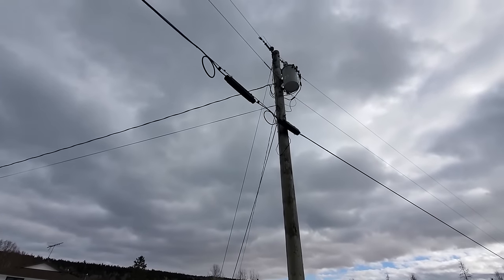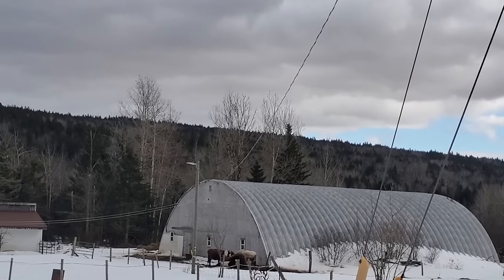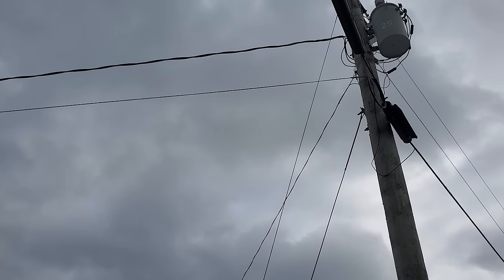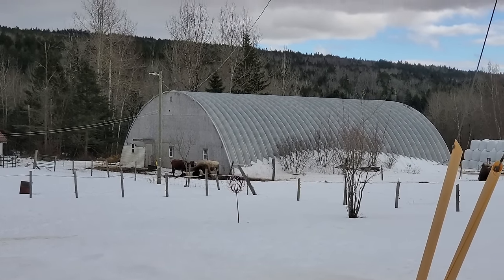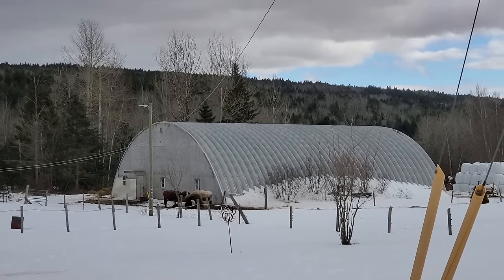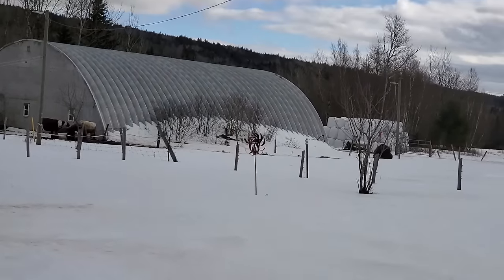Starting here at this location, we'll be able to eliminate a couple of hazards. First, we're going to de-energize that line so I don't have to climb up that pole with rubber gloves on and work on anything energized. We'll shut the power off and then drop that line. From a bucket it's pretty safe to just cut it and let it fly. However, there's quite a bit of tension on it and I don't want that wire to hook along their electric fence and drag backwards - when that lays on the electric fence it's going to send a charge right up through that wire.